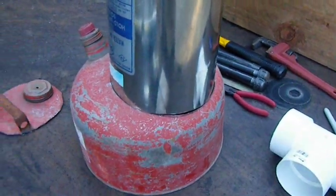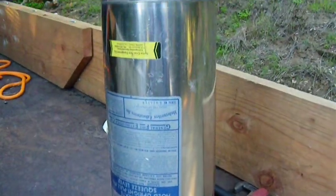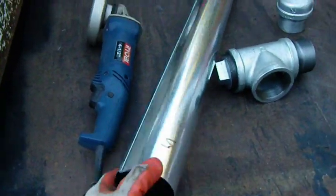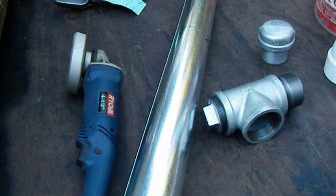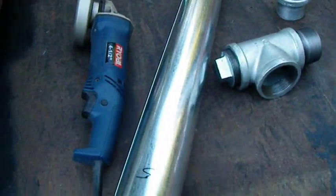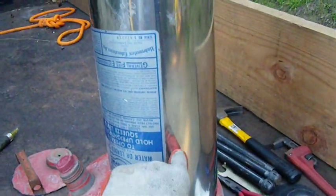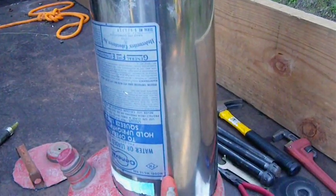And that's going to be where all the heat comes from. I've got this piece of three-inch vent pipe and a piece of four-inch vent pipe. I'm going to put the two together and pack the space between them with an insulating perlite mixed with high temperature cement. That's going to be the updraft tube inside the chamber.